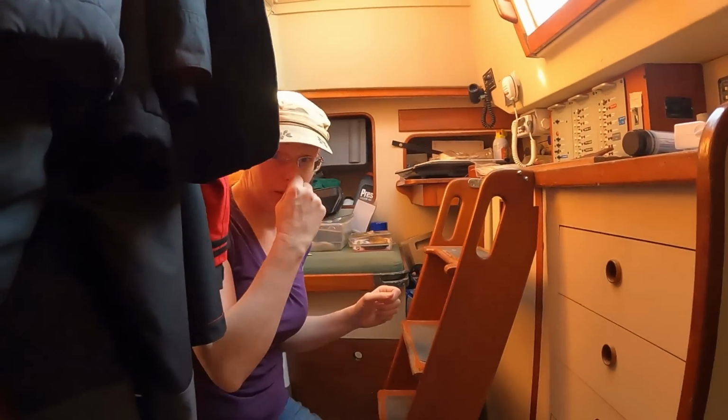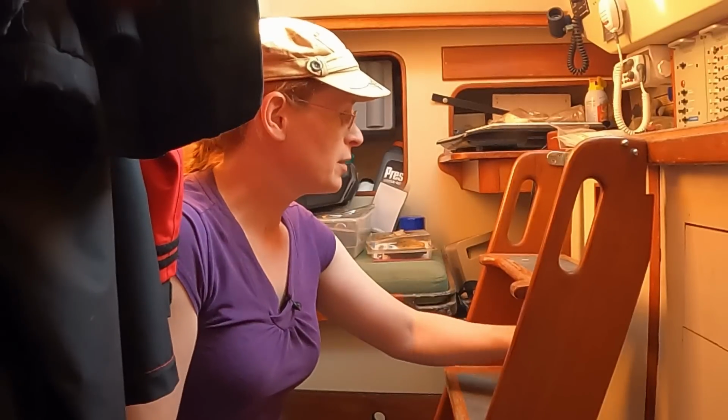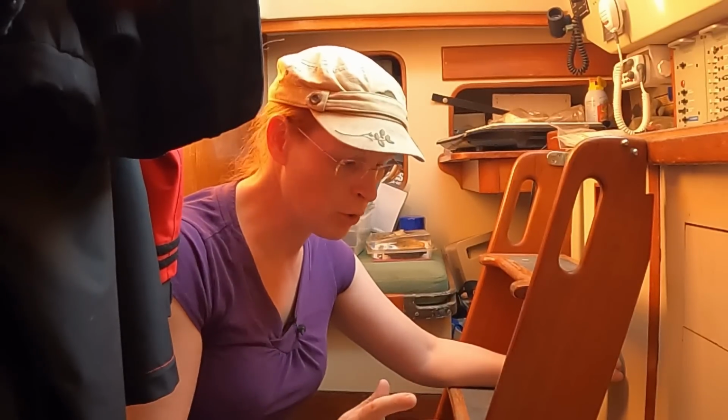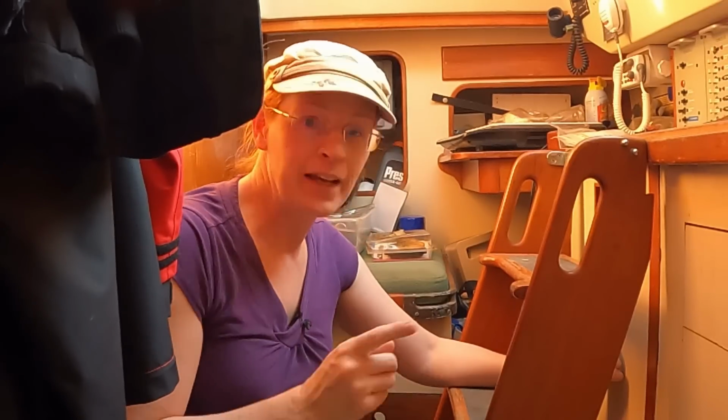So the first thing I need to do, pardon the harsh lighting, it's almost sunset. I bypassed the hot water tank, so I didn't fill the hot water tank with... Oh, wait, because I didn't fill the hot water tank with antifreeze, because I just drained it and left it open, I can drain all the antifreeze first, then connect it and fill it up.